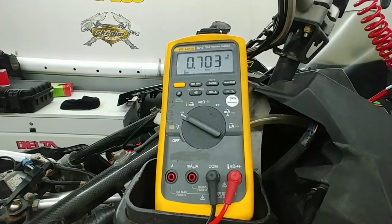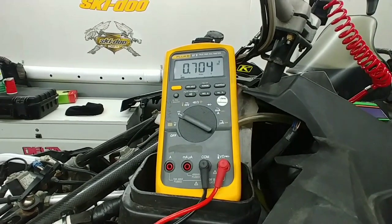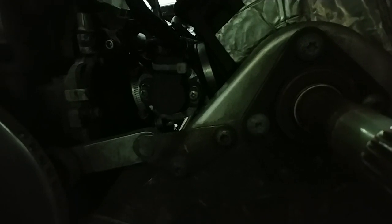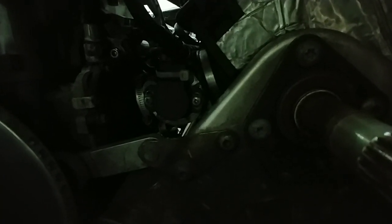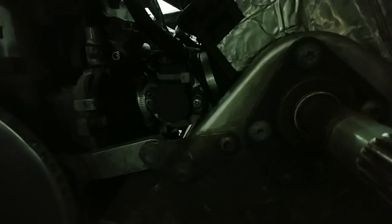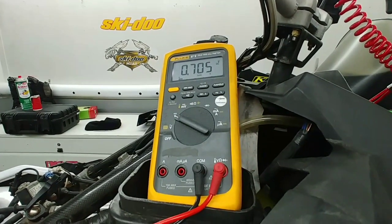I've got it to within about three thousandths of a volt. What I had to do to achieve that is — you'll notice as you tighten the screws down, the millivolts will back off in one direction or another. I had to sit at 712 and then that final tightening of the screws dropped it about 10 millivolts. You can also hold it in place or provide tension on it while you tighten the screws to try to manipulate it. A couple to five thousandths off is not bad.